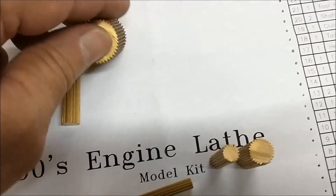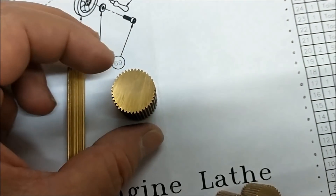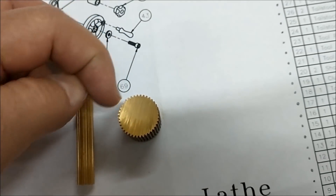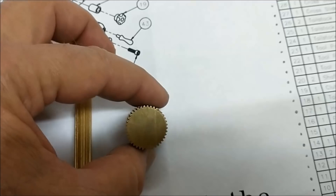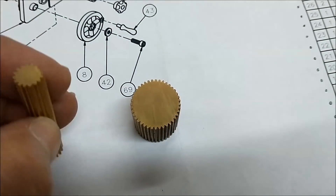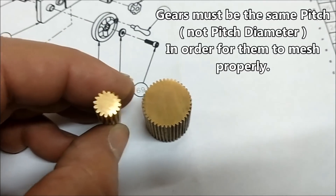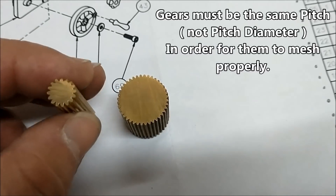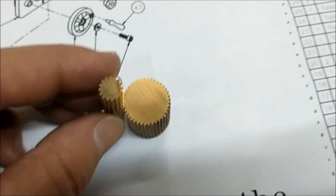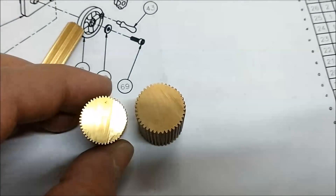This is a 48 pitch gear — that has nothing to do with how many teeth are around the outside. I think that means 48 teeth per inch — correct me if I'm wrong. You can have a 48 pitch gear of a smaller diameter, and the small one looks more aggressive than the big one just because there appear to be more teeth, but they actually go together and mesh. This is a 64 pitch — you can see the difference in the tooth profile.